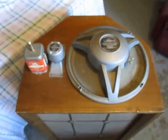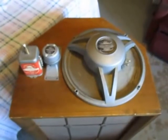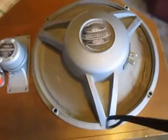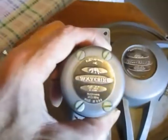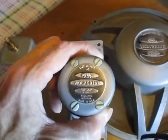These speakers were available assembled or in kit form so you could do it yourself at home. You could also buy just the box by itself and then buy the individual components one at a time as you had the money to do it. It's got a nice little metal grill on the front. This tweeter here got damaged so I replaced it — this tweeter is a TW35 ElectroVoice horn, one of the tweeters that was available for it.